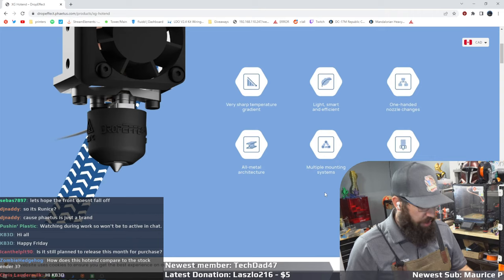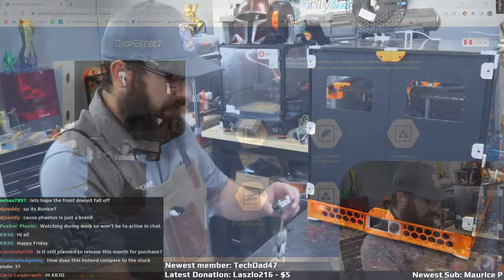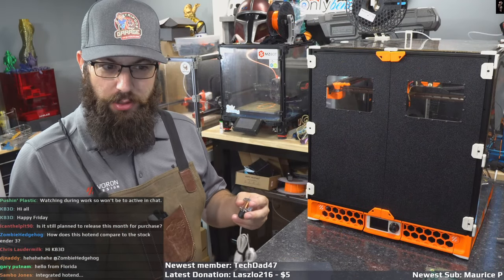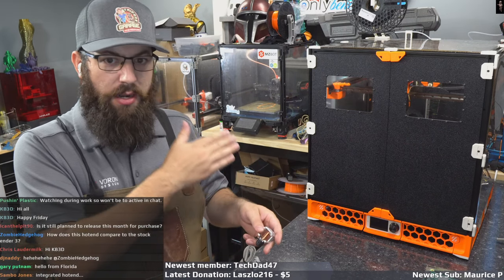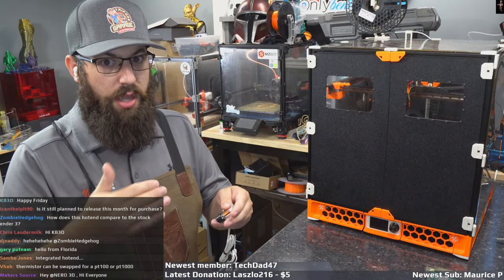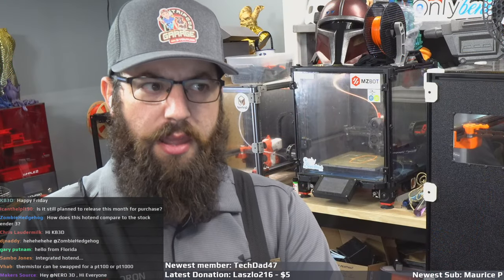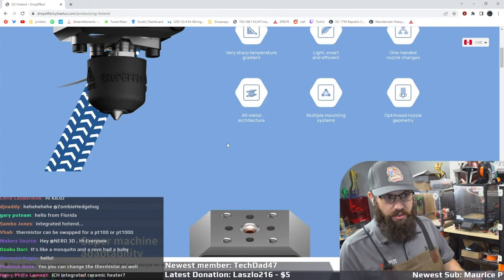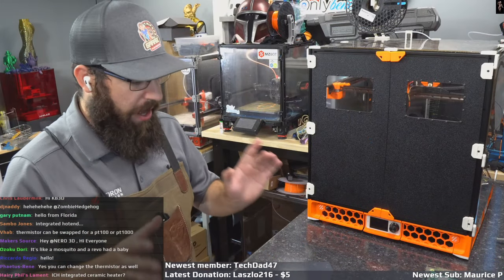And then we got a nozzle, which I'll touch on in a bit because it's not a standard nozzle. So it is a rigid mount, okay? Now, it's also a kinematic mount. So I'm assuming this is how they're bypassing the Slice patent on rigid mount heater blocks and unsupported heat breaks, because it's not rigid, it's kinematic. It floats, but it doesn't. I don't know. I'm not a scientist. I'm not an engineer. I'm not a lawyer. But I haven't seen anyone bring up anything counter to this, so I'm assuming it's good because it's a different cell.